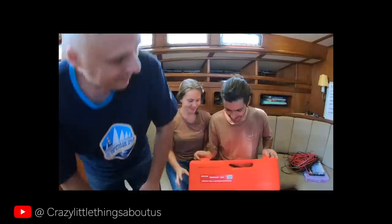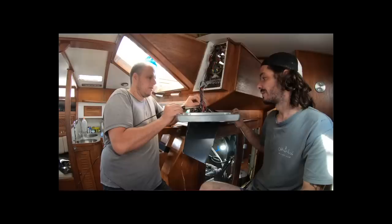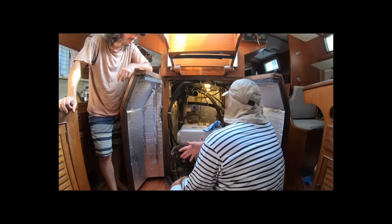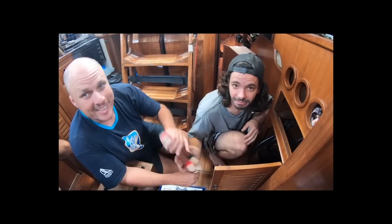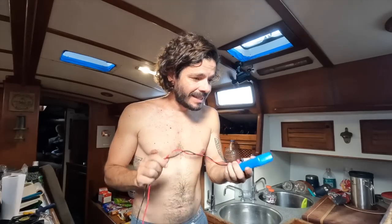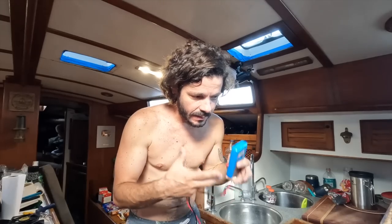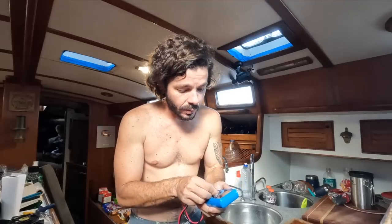According to Fred — he lived with us for over six months during the pandemic and so much of what we know about electrics, plumbing, mechanics, and other boat systems we learned from him. We call him Guru Fred. We need to check if there is energy on the wires, because maybe the fan is fine but the wires are not energized. I'm going to try to turn on the freezer and as soon as the compressor kicks in, we need to see 12 volts on the wire.